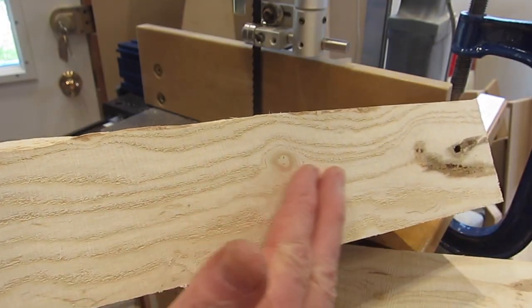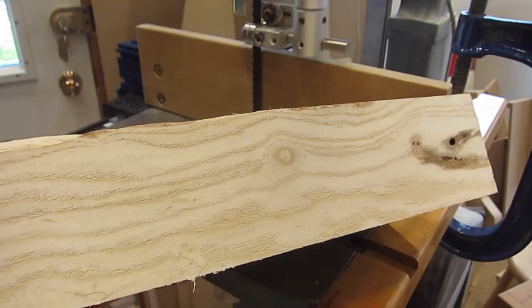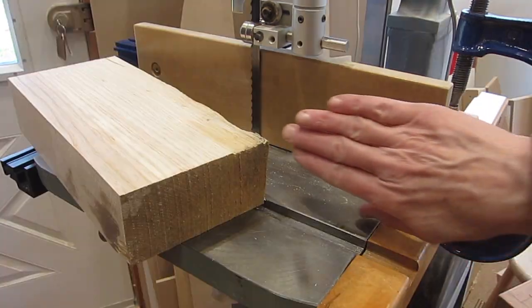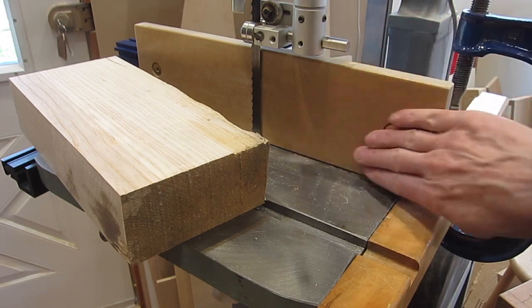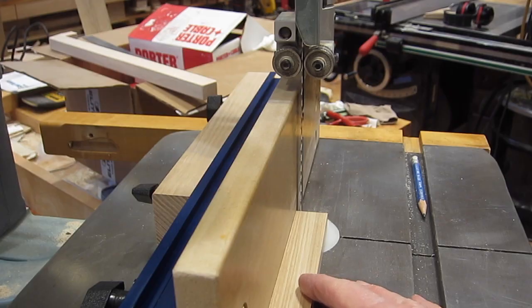And it may be hard to see, but you can see how smooth that is, even with a three tooth per inch blade. I did apply paste wax, two coats to the surface here, and also to the backside, so that I get smooth sliding on the MDF.